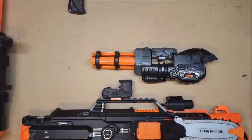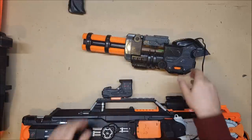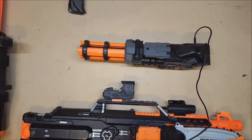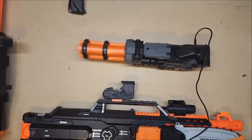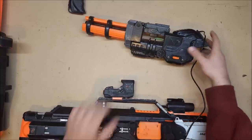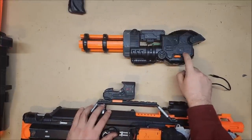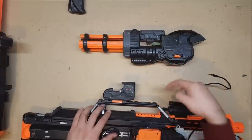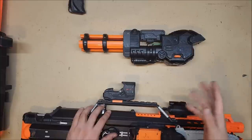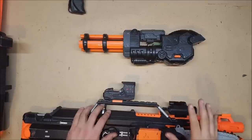The plug for it is on the back right there. There is then an on switch which turns on the flywheels. So while in combat I'd reach up and turn on the flywheels and it just stays on, and then when you pull the trigger the barrel rotates and the belt feeds. Originally this one was remote controlled with a two-channel remote — one channel that turned on the flywheels and the other that made the gun start firing. Like the original one, it would just keep firing until it was out, and I absolutely did not like that system. All the different motors in this thing had a tendency to disrupt the receiver because of all the electromagnetic interference, so it was really hard to get it to turn back off once it turned on. So I scrapped the whole remote thing and made it just fire using IRA's secondary trigger.